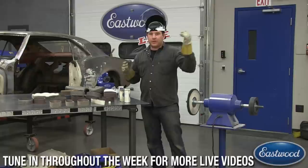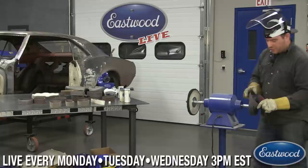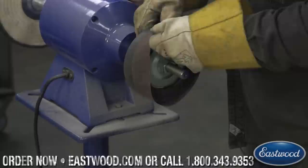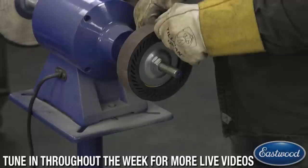With the expander wheel versus a grinder — one slip with a grinder and you're going to put a big gouge or cut in your part. Since the wheel deforms, you don't have that issue as much. So yes, it would work for rust pretty well. I would keep my bands separated though — if you're doing really nice finish work, don't use the same bands you'd be using for rusty stuff you're trying to clean. Once you get the process down, you can swap wheels really quick, which is nice.